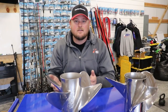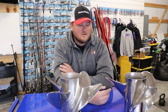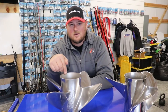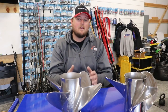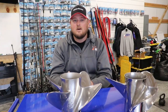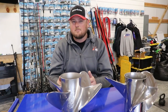The Fury 4 does a great job lifting heavier boats out of the water, and it also has great slow-speed maneuverability. I was running 3-blade props forever and never thought a 4-blade would make a big difference. But I started running the 4-blade Fury when going to big water — like the Great Lakes. The thing you want for big rough water is extreme control over your speed and throttle. When you're battling 3- to 6-foot waves, you want to be able to slow down on a dime if you misjudge the next big wave, and also speed up fast to get over the top of it. You want a prop that is very responsive.